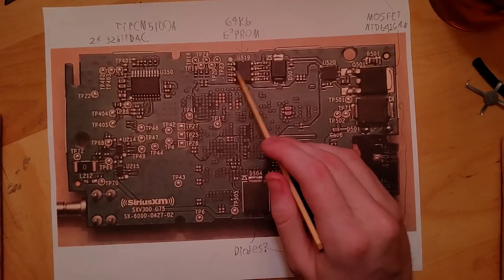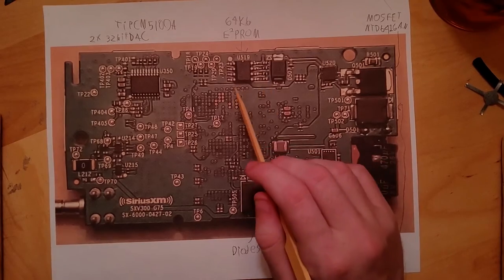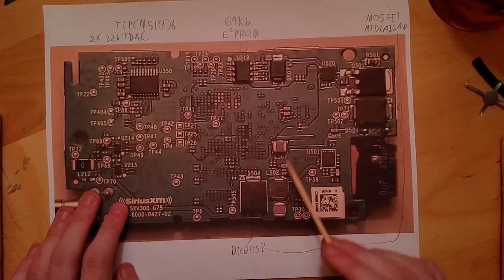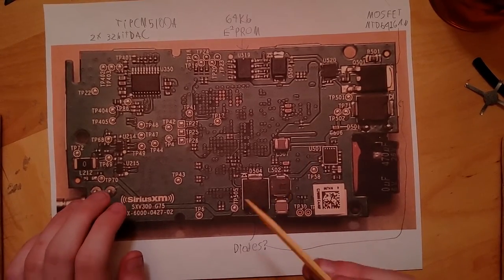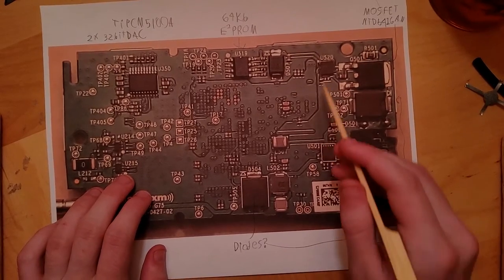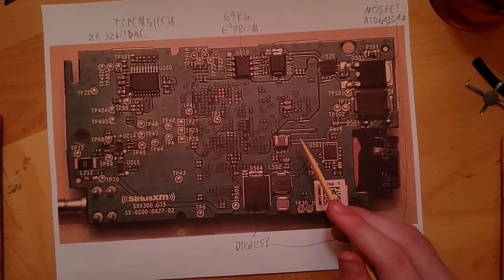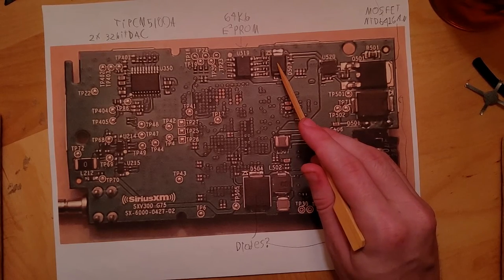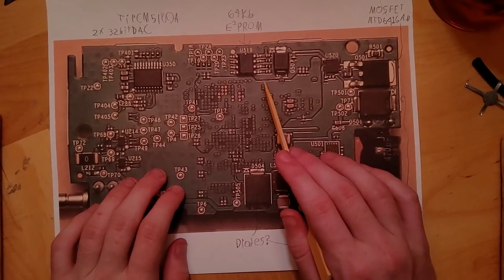This one is, I think it said an onsemi. Speaking of onsemi, we got a couple of onsemi components here. These two here seem to be diodes, by looking at them. They have the onsemi logo, the onsemi circle. Not sure about these two components here because they did not have a number on it. This thing here, I could not get a search on. But it's marked down as a diode, so it might be a flyback type thing or a reverse polarity.